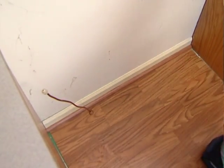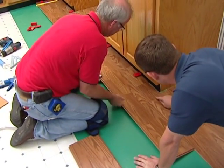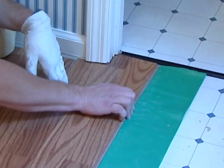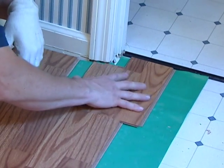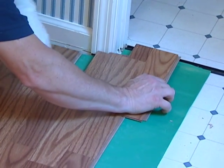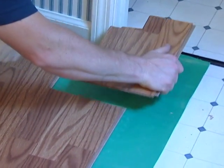You may have to disassemble the flooring due to obstructions, etc. Just lift the row of planks a few inches and tap along the joint. The release planks can then be pulled apart by sliding them out horizontally. Never bend connected planks downwards — this will damage the planks' locking ridges.